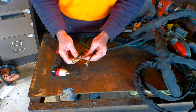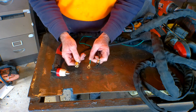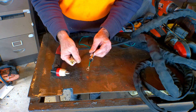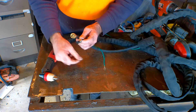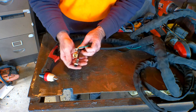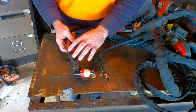The connections on this are just the same as a normal plasma torch on your generic Chinese plasma cutter, because that's all I use. So this is your standard 16mm fitting where your air goes in, this is your on/off switch, and we've just got this extra wire here - see this extra green wire? That's the pilot arc wire, and that's basically the only difference in the fittings.